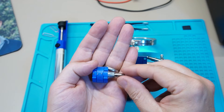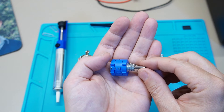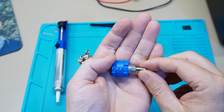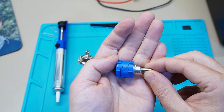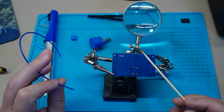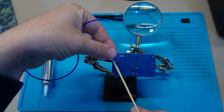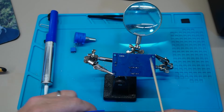When I tested this, it's the 10K multi-turn potentiometer — I just got that off eBay for about $10. You can probably get them cheaper on AliExpress, but for the sake of this project I wanted to get the part a little bit quicker. So what we're going to do is get some wire in three different colors — it doesn't really matter what you use, you just have to make sure you line up the correct pin orientation with the pins on the new potentiometer.